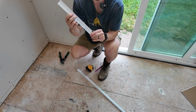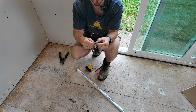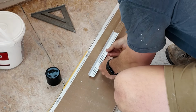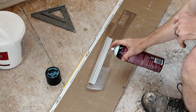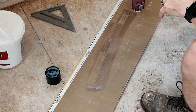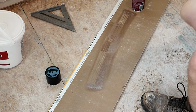So there you go. You got to make sure that you're obviously putting it on correctly. The peel away strip is the smaller end on the front here. So you want to make sure you're putting your glue on the back. So let's do that. Backside. Just going to do one pass. Just 2 clean passes. So I've been giving it like 15 to 20 seconds to sort of gunk up and get set in.